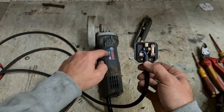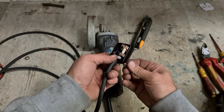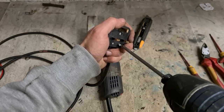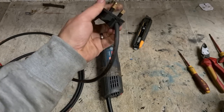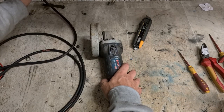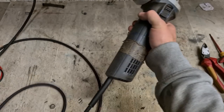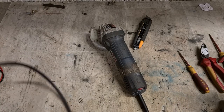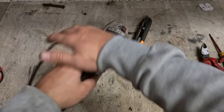That's what you should be left with. Obviously it's a double-insulated machine, so there's no earth. Plug on, clamp grabbing the sheath, everything to the right size. All right, that's another one done — that's number two, another one fixed.